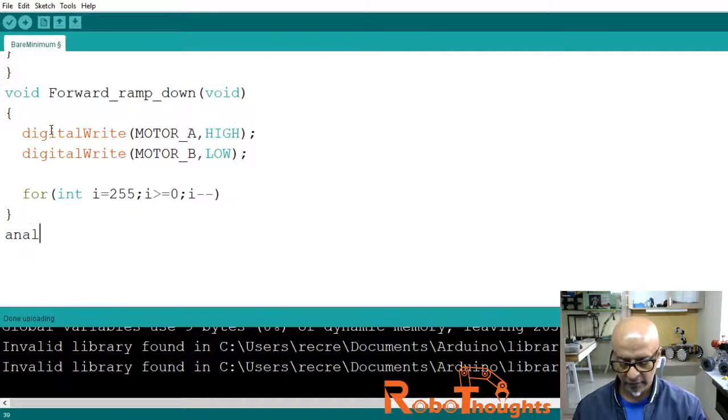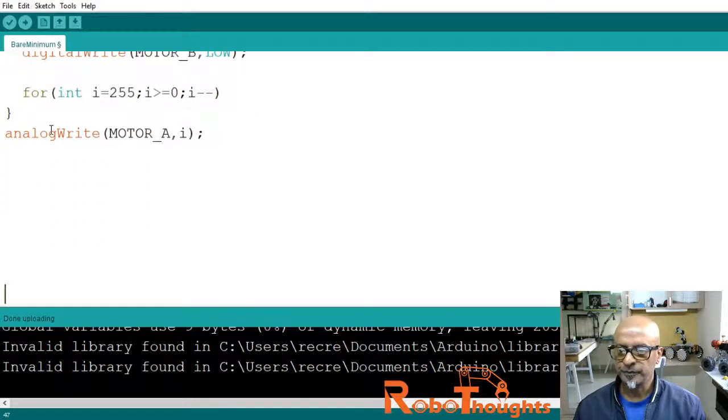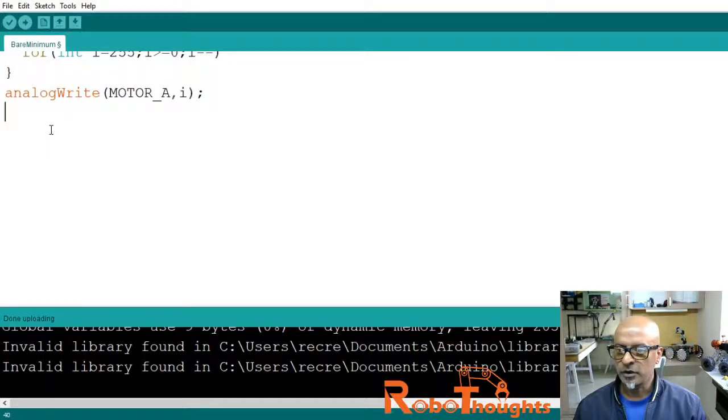And then analogWrite motor_A, i, semicolon. Okay, then we will delay for a very short period, say 15 milliseconds, like this. All right, let me close this block of code, close it again, and then we will use the same statement